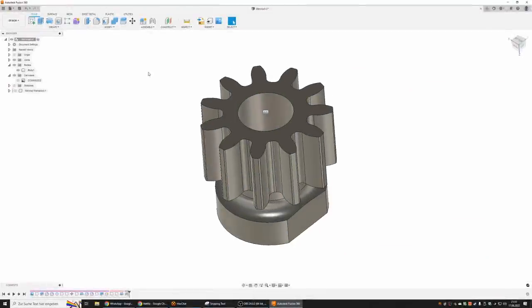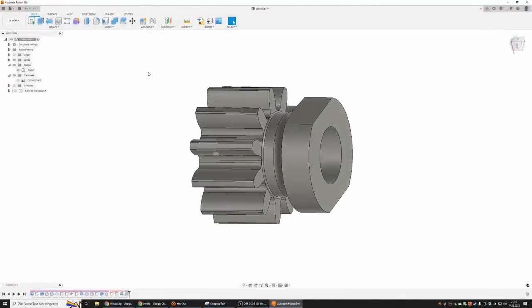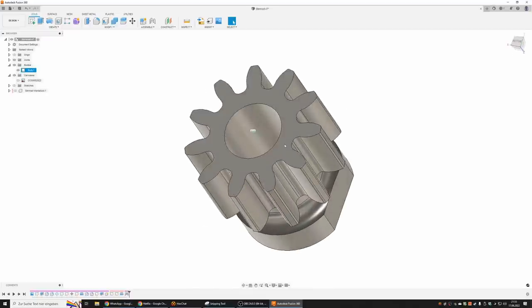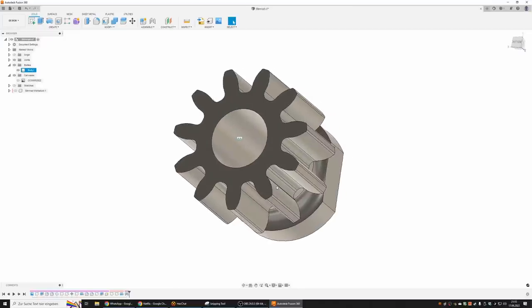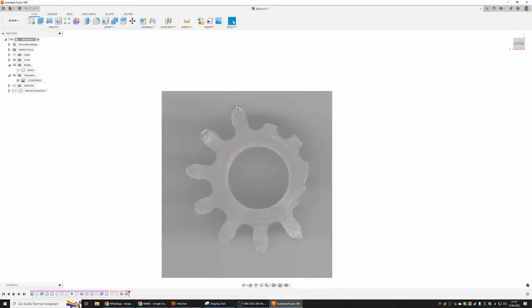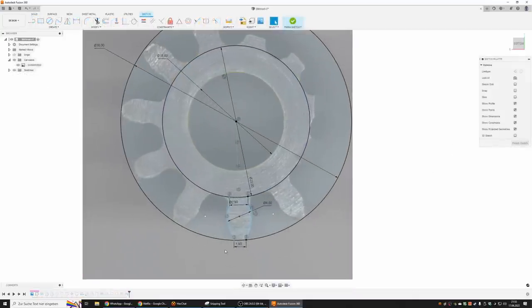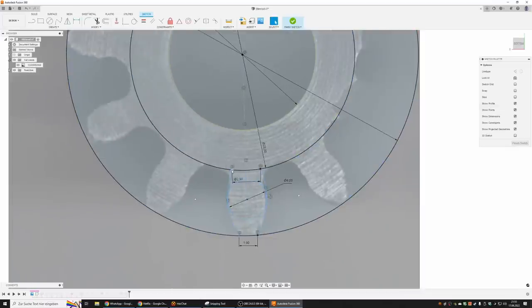Here we are in Fusion 360 and you can see the gear as I designed it off the gear supplied by the customer. Very simple part apart from the actual gear teeth. Since they didn't match any module gear profile or diametrical pitch gear profile that I could find, I decided that it would be easiest to put the original gear on a flatbed scanner, an office scanner, and pull the scan into Fusion 360 as a canvas,